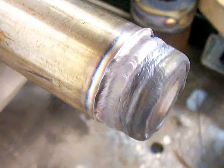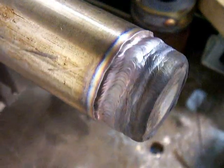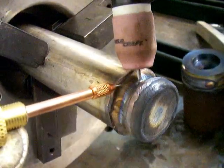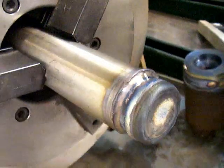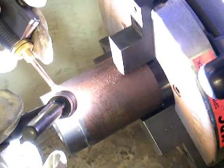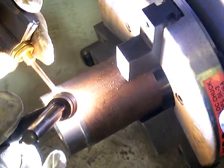For doing round parts like shafts where machining is going to put threads back on, there's a lot of welding involved. Without a positioner, you'd have to reposition every half turn — just keep turning the part over and over. That takes too much time. If you've got a lot of work like this, or if you're in business for yourself, a positioner is well worth everything it costs. You can get one of these for around $1,000 to $1,200, maybe a little extra for the chuck, but well worth it.